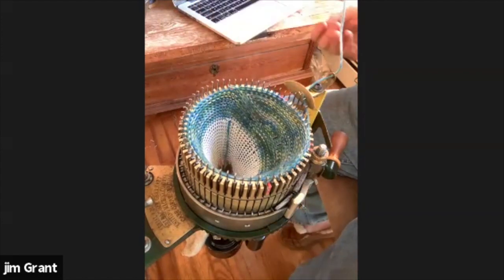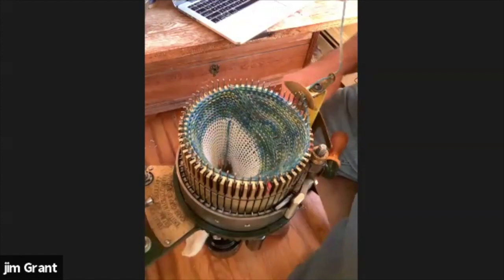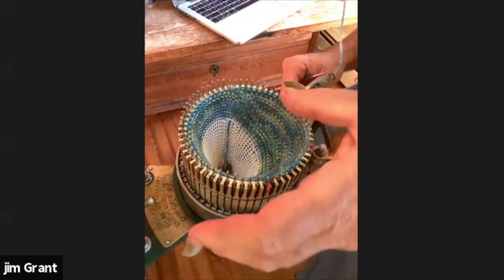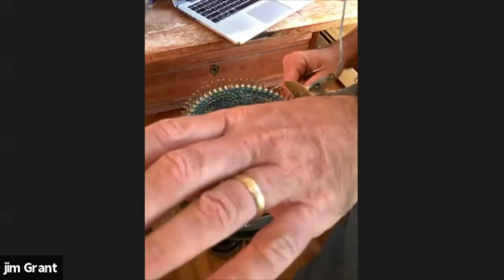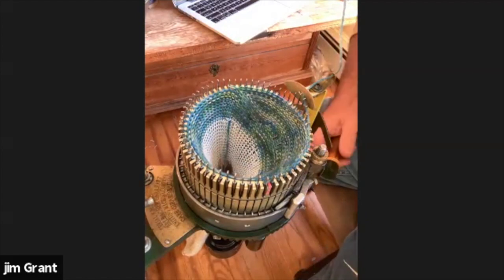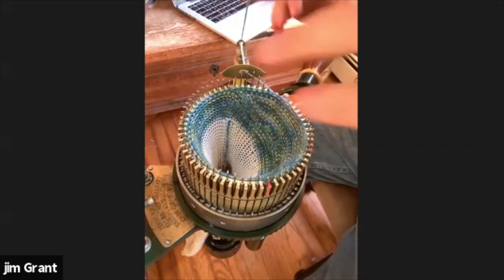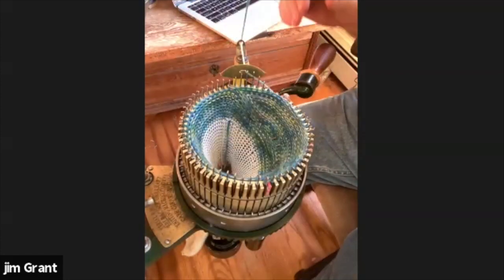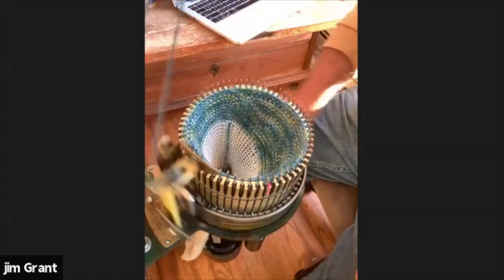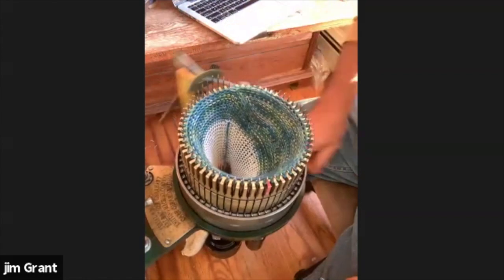All right. So this is when I'm starting, I'll keep my left hand right here. And you want to set your counter back to zero again. I'll keep my left hand here so that if you were to drop a stitch, you could press it right against the sidewall and catch it before it runs. So I'm going to go nice and slow. My heel spring is off. All my latches are open. And I'm going to do 10 rows. And we're going to stop at 3 o'clock. You want to make sure you leave all your heel forks on, all your weights are on.